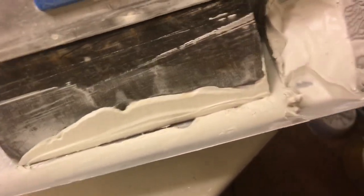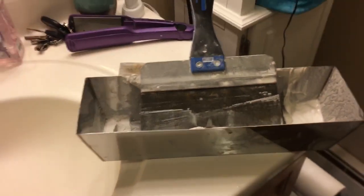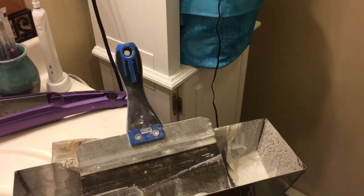The ceiling is done, we're going to let that set. Skim coat's nice — a little light sanding and we're going to paint. Sometimes you have to give those spots two or three coats because it shows through. Now I'm going to clean up this mess. Always clean your tool out before it hardens — put the big chunks in the garbage and rinse it in the sink. Keep it clean; if you get into a jam you can chip this stuff out. Caulking and painting will be next.